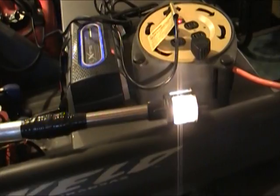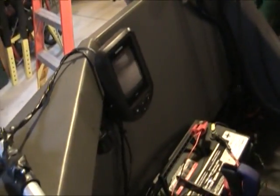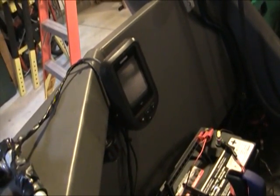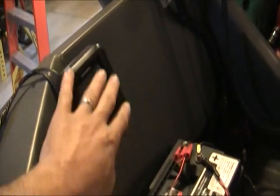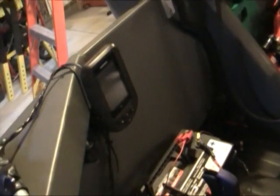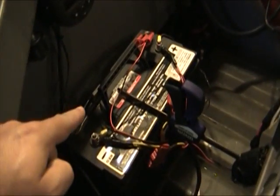You're going to have to have lights on the front and back of the boat — this is just a homemade stern all-around light I put on there, something sweet and easy. You're also going to want a depth finder. It lets you know what depth you're in, and if fish are working three feet of water at one spot, they're probably going to be in that same three feet at another spot. And if you get one like this that has GPS, at night when you're out in some of those places it can be hard to find your way around — it'll let you follow your breadcrumb trail back out.